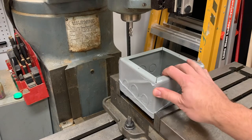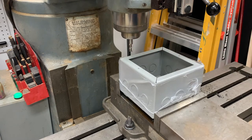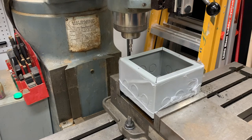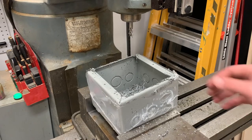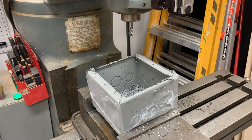So we're going to do a little milling to cut out the sides of the box. I'm going to trim these back a little bit to get about another half inch, and then we're going to use the CNC router to make a nice control panel cover for this box. Here we are at the mill. This box is actually at the extreme end of the capacity of my vise, but since we're not going to be taking huge passes, this is going to be okay. I'm using a 3/8-inch diameter four-flute end mill. I'm going to buzz off the two faces that don't have the holes. I took a bunch of passes and went slow and had a little bit of trouble keeping the box in my vise since it's not a very good geometry for cutting on a mill - the box got all kinds of flex in it. But I did get through it. I'm going to touch it up with a little file and then we'll measure it and go over to the CNC router.